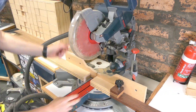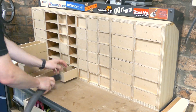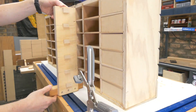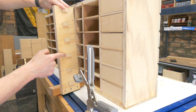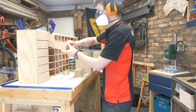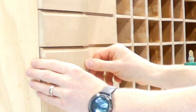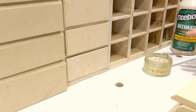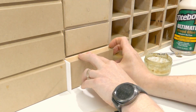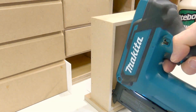Here's a handy hack to make sure your drawers are fitting perfectly: if you can get them out with a vacuum they're good; if you can't, you need to sand them down a little bit more so they're not too tight. Using the clamping bench to its full potential, a little jig pushes them out about six mil and supports them from the back. With no back on this set of drawers, holding them proud I could paint some glue on the front — a little bit of super glue with no activator so I had a few seconds to manipulate it — and use spacers of about two or three mil to mount my drawer fronts.